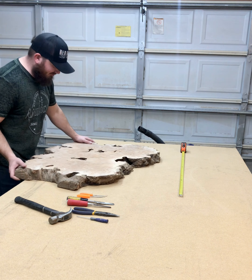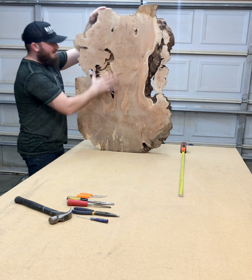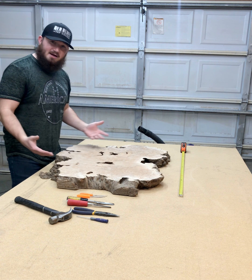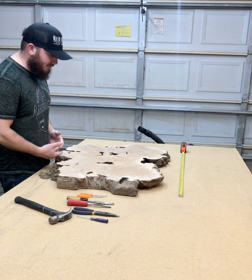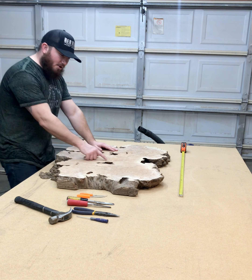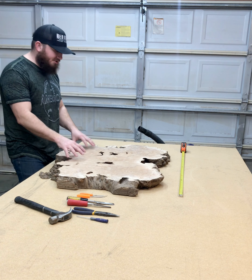So what I'm going to do next after I'm finished digging all these holes out is tape off the bottom here. I'm going to apply the tape so that when I pour the epoxy in the holes, it doesn't seep out everywhere. There's no point in building a huge box around this to keep the epoxy in. The trick is to put the tape on the bottom so your epoxy doesn't flow out. Make sure your tape is really secure on there. After I do that, I'll shoot a bead around each hole so that the epoxy doesn't spill everywhere and get all over my project.